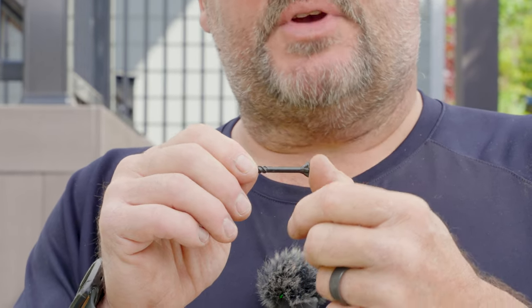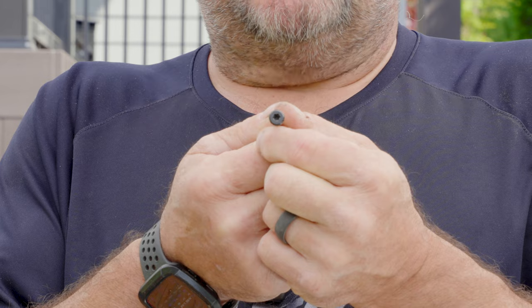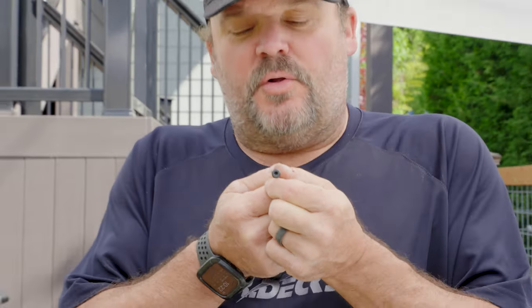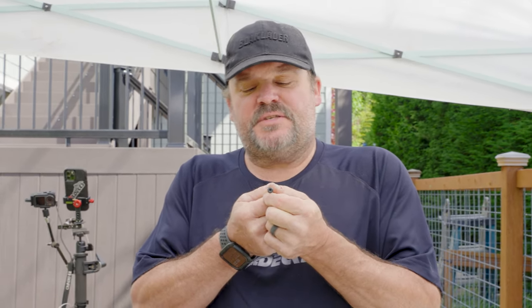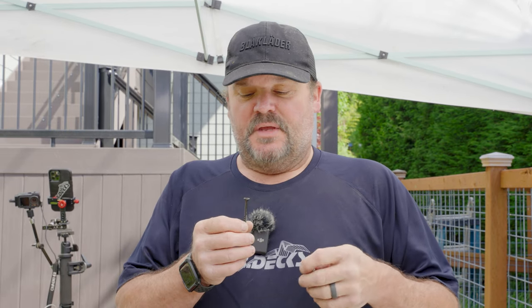There's also a blank area, and then the actual head — on the bottom side of the head there are cutters that help flush the top of the screw. Usually when I'm framing I'm subsetting everything. If you wanted a nice finished look or a decent size head that's going to pull down on a piece of material — like a top cap on a handrail — this is not a bad option and has good pulling power.